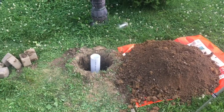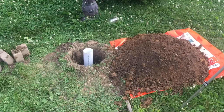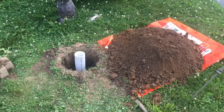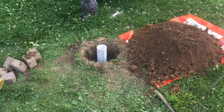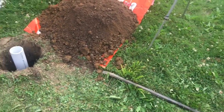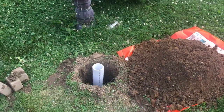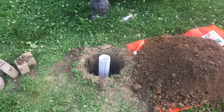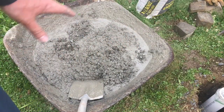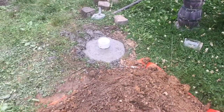Remember something: I have extremely dense clay soil with a lot of rocks and roots, so I have five times the pipe diameter in hole width. You don't have to go as wide as I did. If you have sandy soft soil where it's easy to dig — this hole took me over an hour — you could just use the post hole digger, but you're going to have to put in more cement if you want that wind load rating. Now, a quick word about pouring dry cement in a hole compared to mixing it first: you're always better off mixing it first. You get a much better, much stronger mix. Okay, there's the initial pour. We're going to let that set up, then brush it around the bottom a little bit.